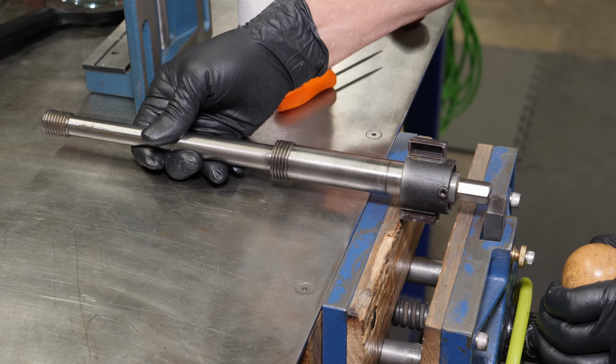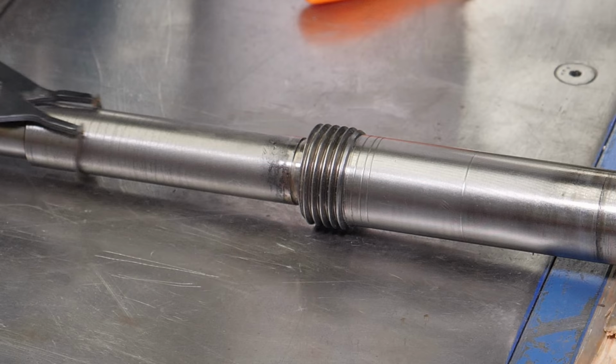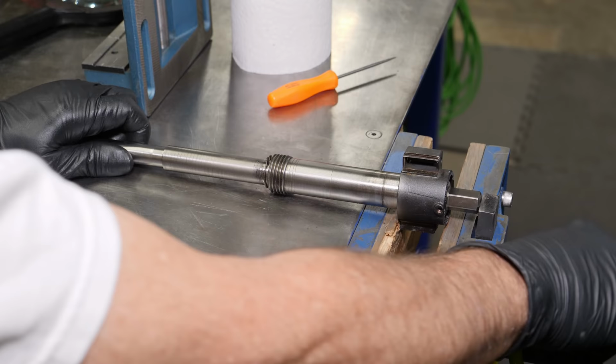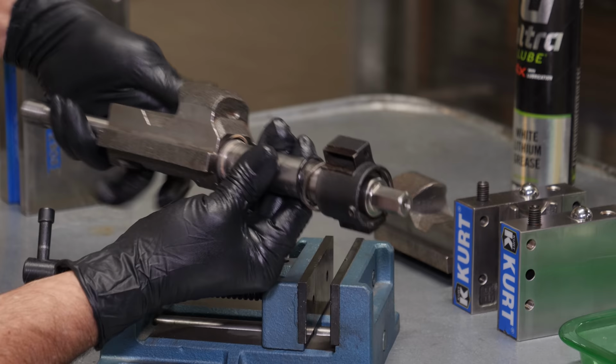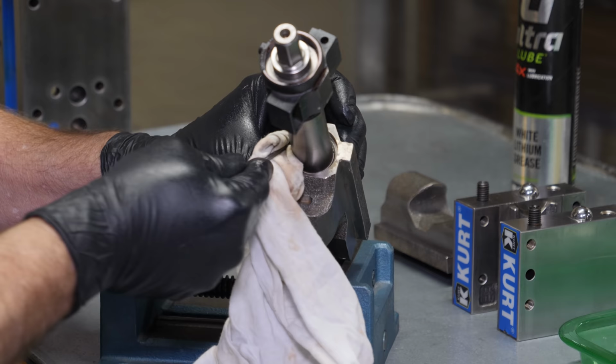And again, I didn't take off the internal snap ring or clip or detent or whatever it is on the inside of the shaft. And yes, I went back and cleaned that little bit of rust off. It's amazing what you don't see with your eye that the camera does. There's four springs inside that brass or bronze piece that I was bouncing off of whenever I was compressing the shaft up and down. As well, there's a thrust bearing behind that, and whenever you have the collar installed, that sets the preload on the vise.